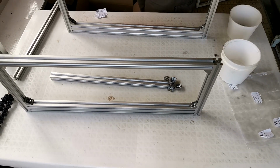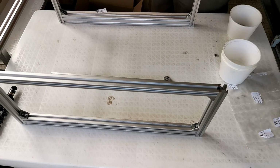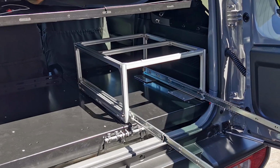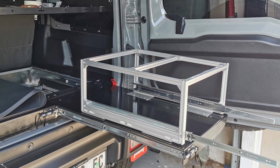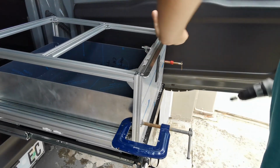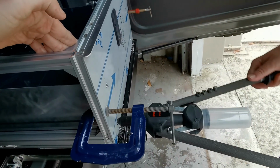It is a nice, neat, clean way of working, and provided us with a nice lightweight frame system, which we fixed drawer runners to, and then installed an aluminium casing around the outside and an aluminium drawer to the inside. So overall, that drawer unit is actually quite a light unit and is easily bolted to the right hand slider and works very well.